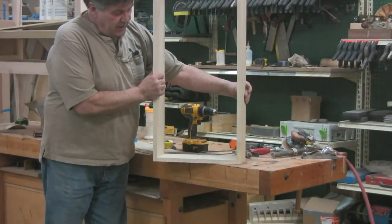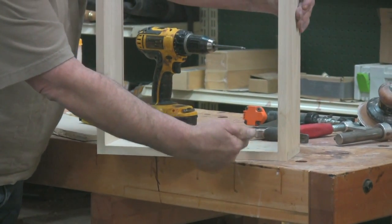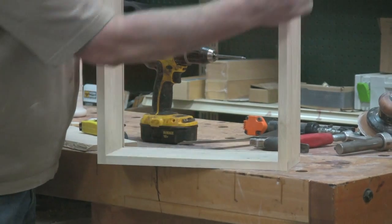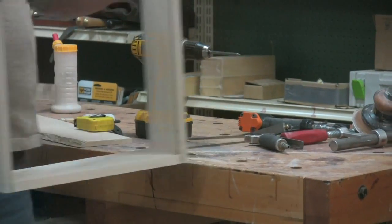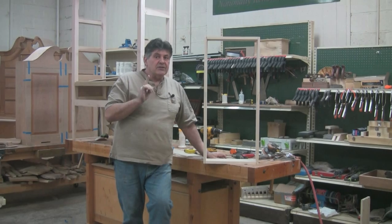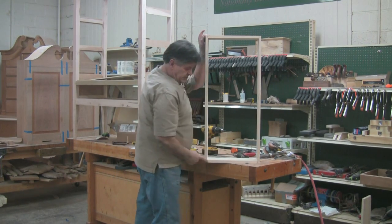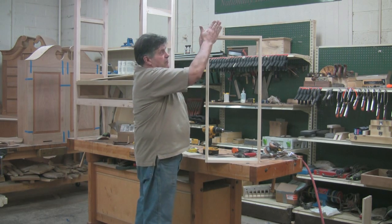Let's assume this is sitting on the jointer. We bump it this way so that the knives are cutting into it and get just past the dovetail, then turn it around and go the other direction. Now, if you're going to use a jointer, listen carefully. It's best to do it before you make the provisions for the runners, because that'll give you a flat surface here.